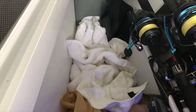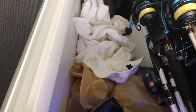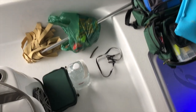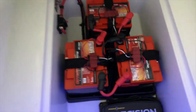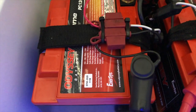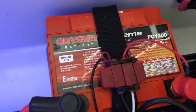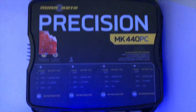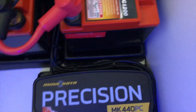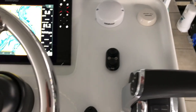When traveling, I remove the rods and fit all the covers into that compartment, which is really convenient. Underneath the forward deck is the battery compartment for the trolling motors — three Odyssey PC1200 batteries, which are slightly heavier amp-hour batteries but very light in weight, which is great for balance up front. The Minn Kota Precision MK44 charger has a charging lead running back to the house and starter batteries, and three leads going up to each trolling motor battery. The charger outlet is located in the anchor locker.